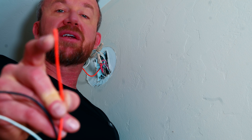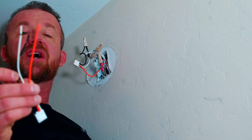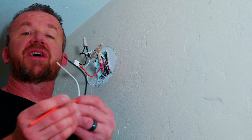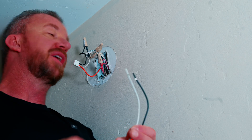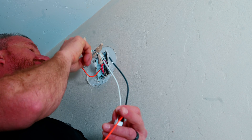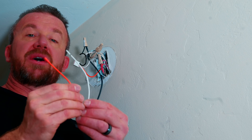As you can see with mine, it is fitted with a rubber end cap that we will have to cut off and strip the wire down to connect it into the system. The important thing is that you do hook up all three wires unless your smoke detector system does not use an interconnect, which is very rare, especially here in 2025. It should have a 14-3, meaning the black, white, and red — and you'll hook up the black, white, and orange to it.